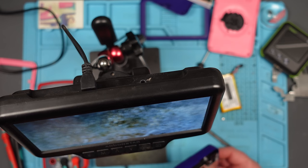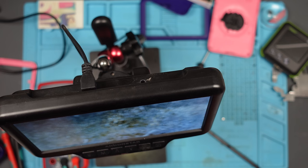I definitely smelt something burning. And the fact that it's still turned on, to me, means it's likely to be the battery management chip. And I suppose that kind of makes sense. If that one is faulty from new, then if it's got a dodgy battery management chip, that battery will have probably failed. And me putting a new battery in has sort of kickstarted the chip again, but then it's properly failed. I think it's burnt out. I don't know. As usual.